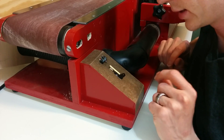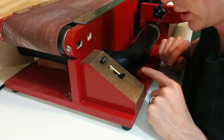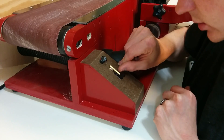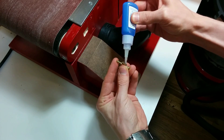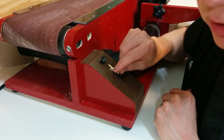For the sander I had to get a little bit more creative. The only moving part to attach another switch to is the main power switch itself. So I added this little brass bar that just slides up and down. Every time you turn the main switch on and off, it slides up and pushes the switch to turn on the dust collector.